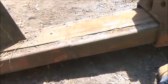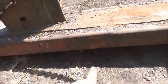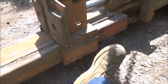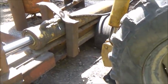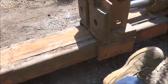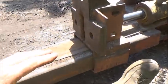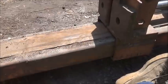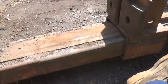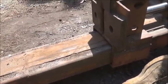And I think I'm going to reinforce this by another I-beam under it, but we'll have to come down back so we don't mess with our travel, and then weld up to it. That'll help strengthen it, but I'm also going to make it where it pins on and off my machine, where I can just pull up to it, drop the double pins in it, pick it up, move it anywhere I want to move it. I was even debating to build this with it upside down. If I was just going to do wood, I'd probably do that. But I'm not. I'm going to be doing rims, so it's going to be a little different situation.